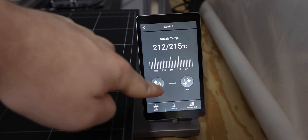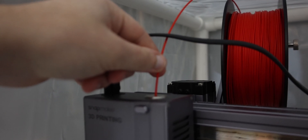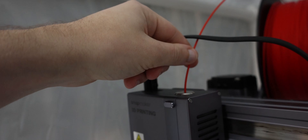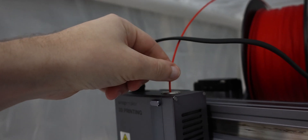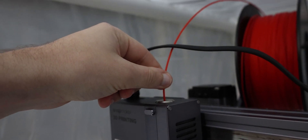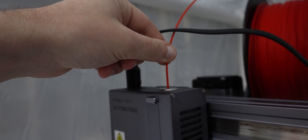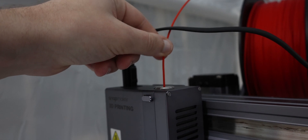When you reach your final target temperature, click unload and then watch the PLA come out. I am not pulling on it — I'm merely like riding the subway, just having my hand on it so you can see it coming out, but I'm not applying any pressure. It's just so that at home you can understand and see the PLA coming out.